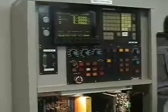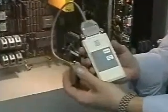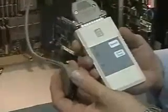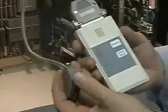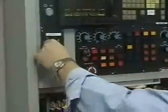To demonstrate the MEMX Data Shuttle 2, the MXDS2, and how it works with the CNC control, we have a Fanuc 11 CNC control, and we're going to demonstrate several of the functions. The very first thing is to plug it into the control. We actually ship a small cable with it that allows you to plug it in, often on the side of the pendant, and then it will power up.